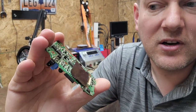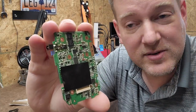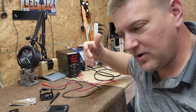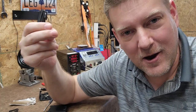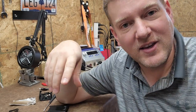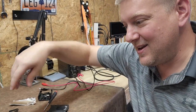It could be salvageable. If that is a diode, I could just remove it with a soldering iron so the short is no longer there — and see if it powers up. I bet it does. The reason it's popping fuses and entering current protection is because that little component is carboned up between the positive and negative rails. Carbon is conductive, and when semiconductors — diodes, MOSFETs — go to a short condition, they turn into carbon. Carbon means short, and that is why I'm popping fuses.